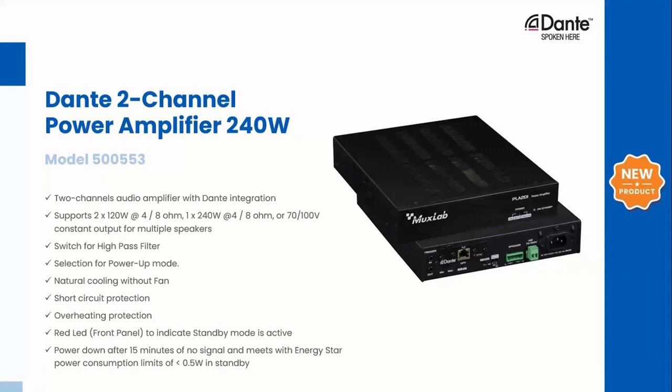So that 70/100 volt speaker we saw earlier can be connected to this output here, and you can daisy chain multiple speakers and drop off a certain amount of wattage on each one. You've got 240 watts to work with.